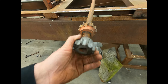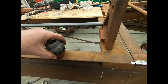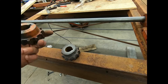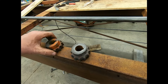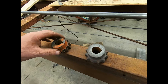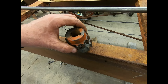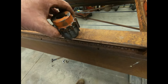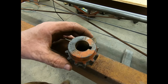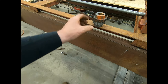I'm not going to take that one off. I'm going to use these two. What I'm going to do is take the one I want to use, set it underneath, and align these perfectly. I'll use this to start the broach with, and that way I can broach them so that they're in line with each other.